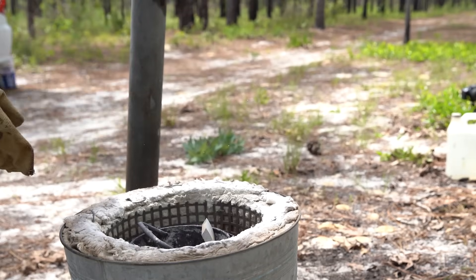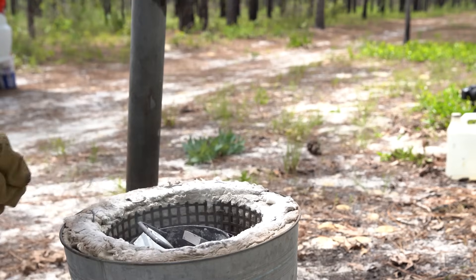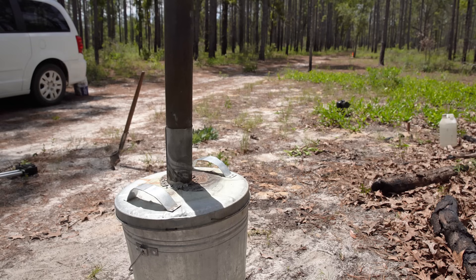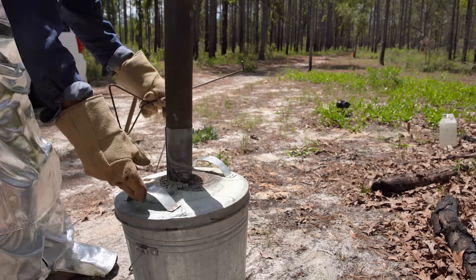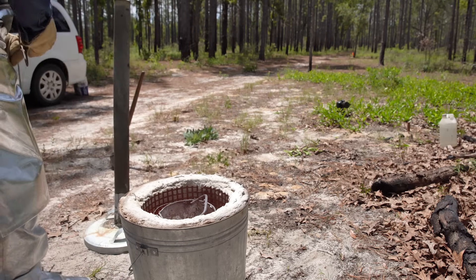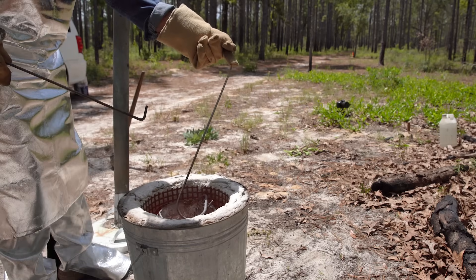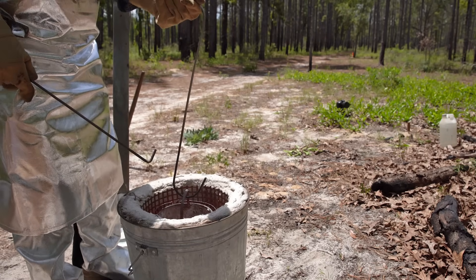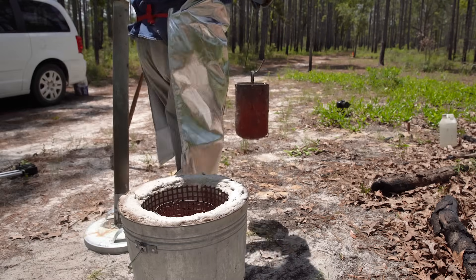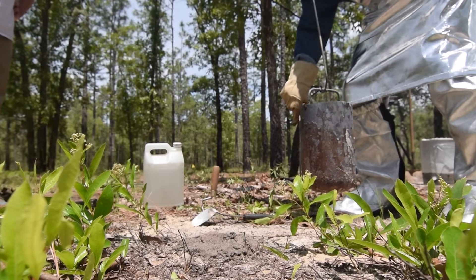For this cast, the metal being used is aluminum, sourced from a cut-up failed scuba tank. After about 90 minutes of heating, fueled by only charcoal and a passive draft chimney, the metal is liquid and hot enough to pour. The first step is lifting the red-hot crucible out of the kiln. Once the hook is looped, the crucible is tipped and the contents are poured.